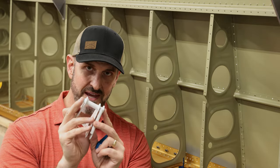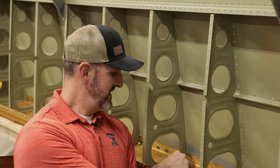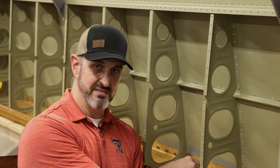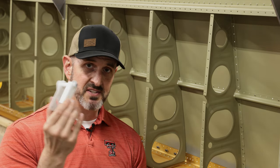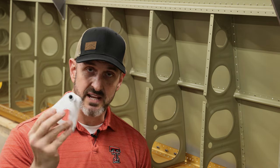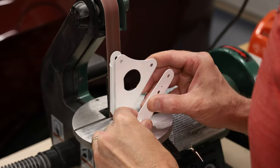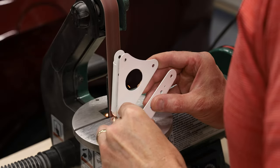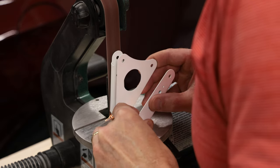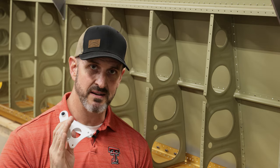What you do is subtract a quarter inch from the distance between the hinges, then grind down the ends of your bell crank so it's equal to that. For example, if the distance between the hinges was five inches, you'd want to grind the pivot tube down to about four point seven five inches. I took the measurements, figured out how much I needed to take off, and took it over to a sander and ground it to size.